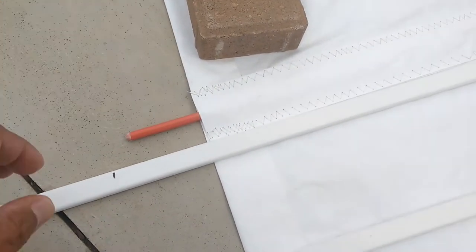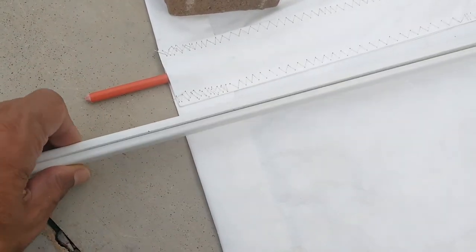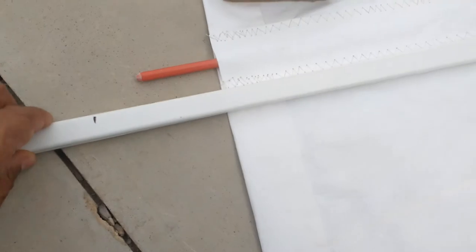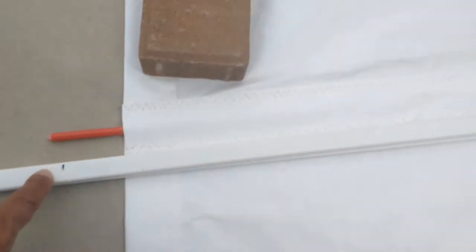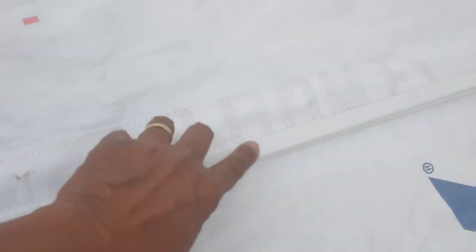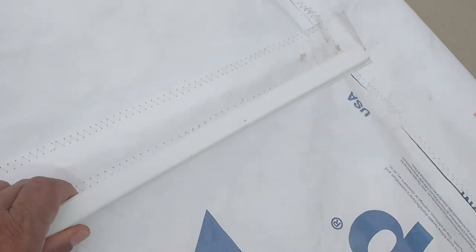I'm going to take two of these pieces and sandwich them one on top of the other. This has a nice bevel on the sides, and if you sandwich two of them you get a very smooth surface on both top and bottom. What I'm going to do to achieve the natural airfoil is I'm going to glue from one end about two thirds of the way into the batten, and I'm going to leave the remaining two sandwich pieces floating. The section that is glued becomes rigid, so the trailing edge of the batten is more rigid than the leading edge, which is closer to the mast.